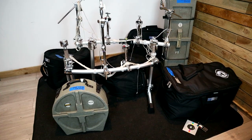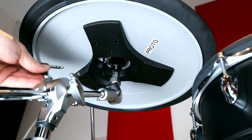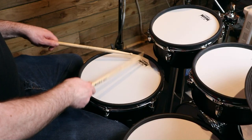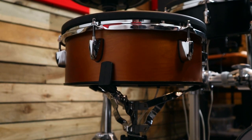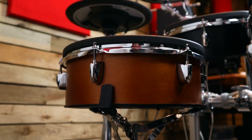Overall the trigger response has been good, but there have been a couple of twists because this kit isn't brand new out of the box — it's a prototype kit that's been shipped around for trade shows and reviews. The first snare pad that came with the kit had a broken solder joint somewhere on one of the piezos inside, which was leading to a dead response after a hard hit. However, Yamaha were super quick to get replacement pads to me. I was promptly sent a brand new boxed real wood finish snare, and then another prototype of the black finish snare so I'd have a matching pad for this video. The final retail pad — the real wood one — actually gave me a better trigger response than the prototype black snare did.